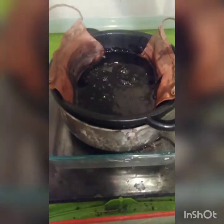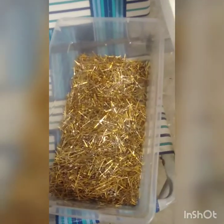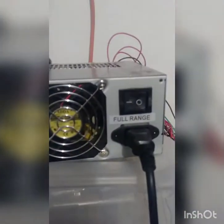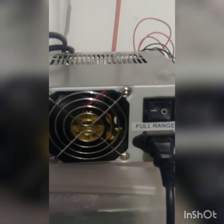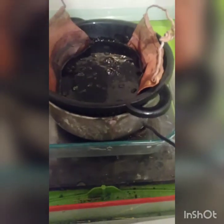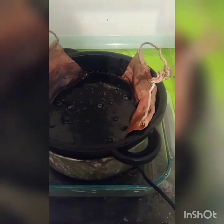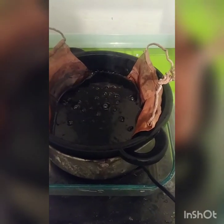What we're doing is a reverse electroplating cell with sulfuric acid as the electrolyte. The material running is gold-plated pins — the total lot was about 41 pounds. I'm using a computer power supply picked up from one of my buyers for free. I'm running a cathode on the stainless steel bowl within a strainer, and I have a pretty good-sized doubled-up piece of copper mesh as my anode. The strainer sits in between and separates them.